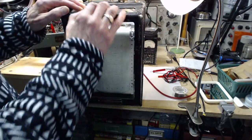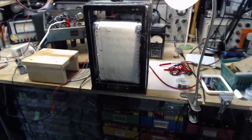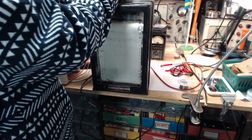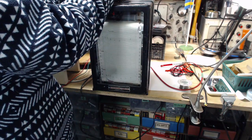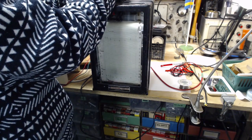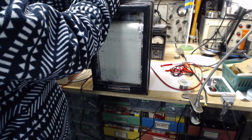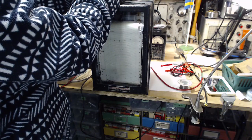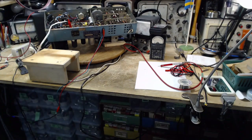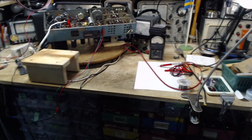And why a recording meter? Because part of the job I was doing involved tracing stray transit system current from the streetcar and subway system in Toronto. Current that drives the vehicles doesn't flow entirely within the transit system. Some of that current gets into water mains and gets onto power company neutral systems. It can get onto gas pipes. And in itself, it's not a terrible problem unless it's a huge current, because it'll heat things up. But it causes corrosion. It causes terrible, aggressive corrosion. And, you know, water mains, all exposed. Gas pipes, all exposed. Old power cables, all exposed. So while you're busy enjoying your transit system, it is eating your underground structures to death.